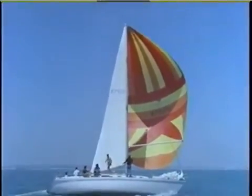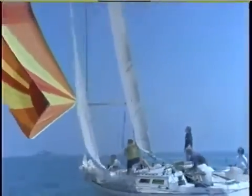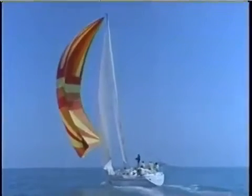But the modern tri-radial is very close-winded, so you'll often find that a very low pole is called for on shy reaches. In many reaching conditions, the spinnaker can be augmented with a tall spinnaker staysail. The tall staysail is about 100 or 110% LP with a full hoist and is made of 3 or 4 ounce Dacron. It's most effective for reaching, with the apparent wind angle between 60 and 100 degrees. Ideal conditions for the staysail are smooth water and moderate air.